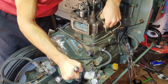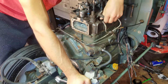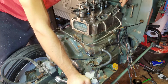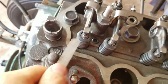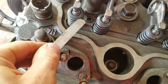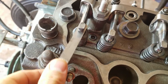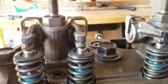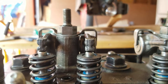Cylinder two right there — you can feel it blowing on your finger. That's the compression stroke. Let's adjust the valves. We're still on cylinder two. Here's my feeler gauge — six thousandths. That one was not too bad, but this one is like an eighth of an inch. You can see that ain't gonna cut it. Let's adjust them.